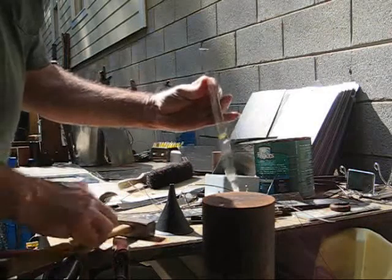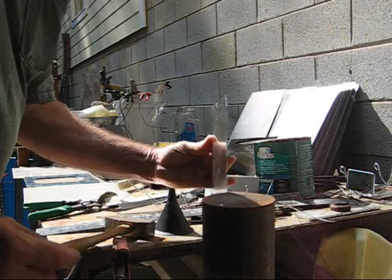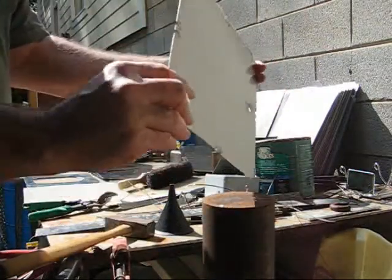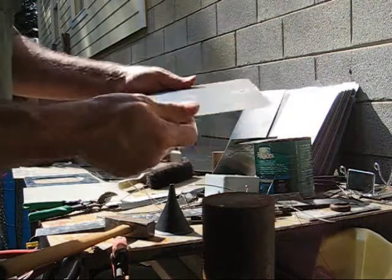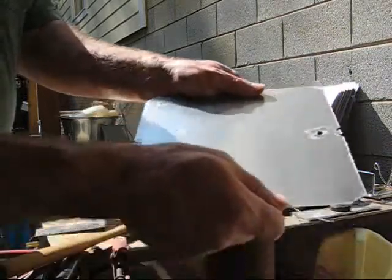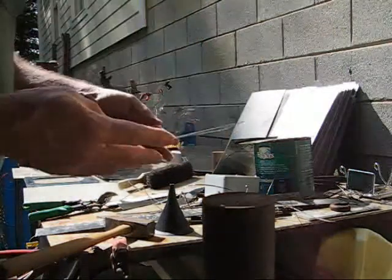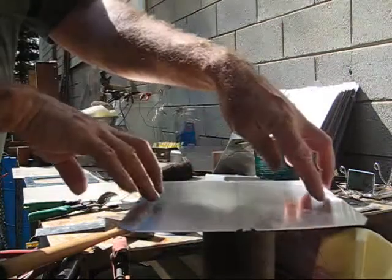It's pretty straight now. It's not going to be perfectly flat, and once you sight down it sometimes you'll see bows. If you see a bow, you have to go on the edge of your kitchen counter or someplace where it's round and smooth and push on it a little bit at a time to work that bow out. You're not going to be able to get them perfect, but get them as close as you can, and then you can rely on the pressure on the gaskets to hold it flat.